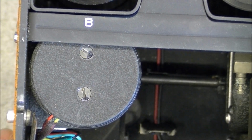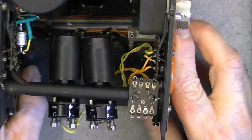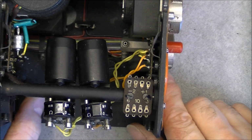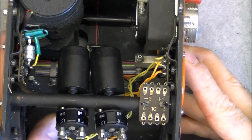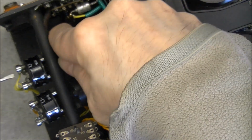What else? Yes, we have here the electrical motor driving the film. There is this plate on the top, but I was not able to undo the screws. They are completely stuck. So we will have a look at these items here. You can see we have 2 of these things. They are attached with set screws you can adjust to set precisely the angle they will go. And in fact it looks like this one is aimed directly at the motor, which cannot be good. So probably they were never adjusted. So I do not feel bad at undoing one.